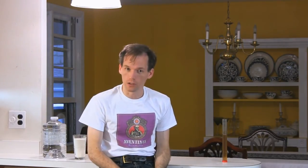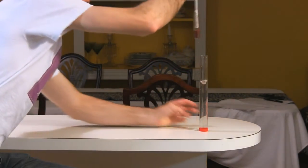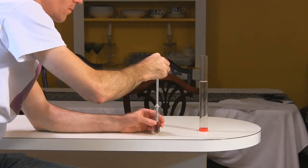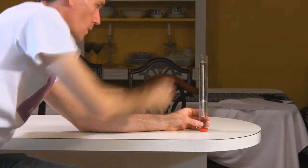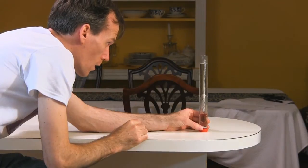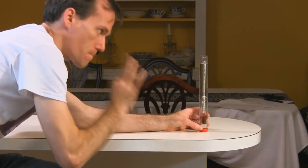It's also important that you calibrate your hydrometer. This can be done fairly simply with a sample of water at room temperature. Without anything in solution, the specific gravity should read 1.000. If it doesn't, tap or jar the hydrometer lightly to move the paper inside. I was surprised to learn how little force it takes to move the paper — rough handling of the hydrometer, even dropping it back in the tube, can knock it out of calibration.